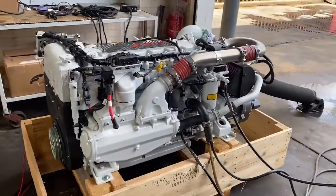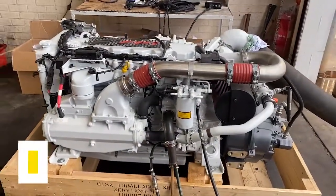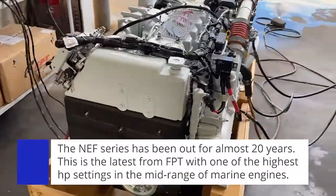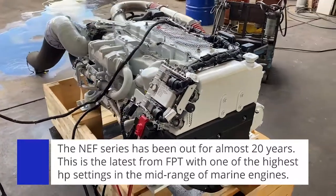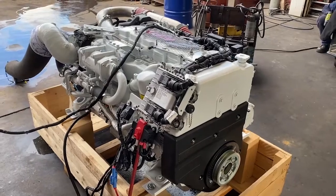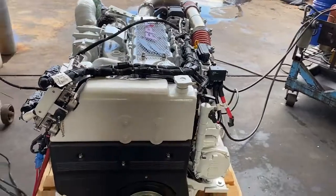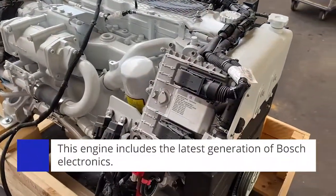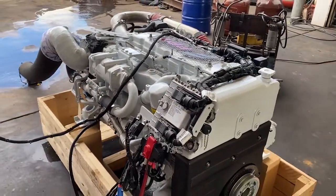The NEF series of marine engine has been out for almost 20 years now. The NEF 570 EVO is the latest from Fiat in multiple regards — firstly, it is one of the highest horsepower settings in this mid-range displacement category. It's a 6.7 litre inline six-cylinder engine with common rail electronics, featuring the latest generation of Bosch electronics, which provides a lot more monitoring for engine longevity.